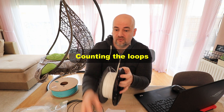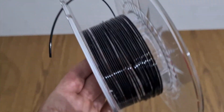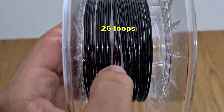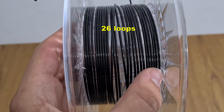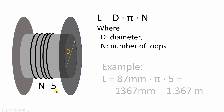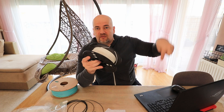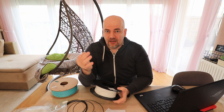One more method is very useful when only a few loops of filament remain on the spool and you need to know if it's enough. If you can count the number of loops, you can calculate the length: the diameter multiplied by pi gives the perimeter, multiplied by the number of loops. This method is quite accurate when the filament is near the minimal diameter, and it's ideal when the filament is already loaded in the printer — especially with Bowden-style printers where every centimeter matters.